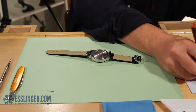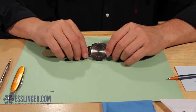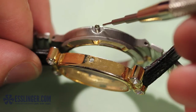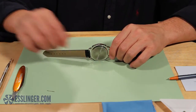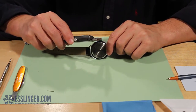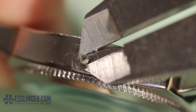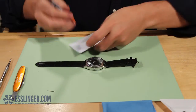Next, you will need to find the opening size of your crown. Measure the case tube if it is a waterproof crown; a dustproof watch will not have a case tube, so you will not need this measurement. If you are missing the case tube for your waterproof watch crown, you will need to take your watch to a professional to get the crown replaced. Holding the watch case on its side, take your digital gauge and use the regular jaws to measure the outside diameter of the case tube to find the opening size of the crown. Record the post-size measurement on your notepad.